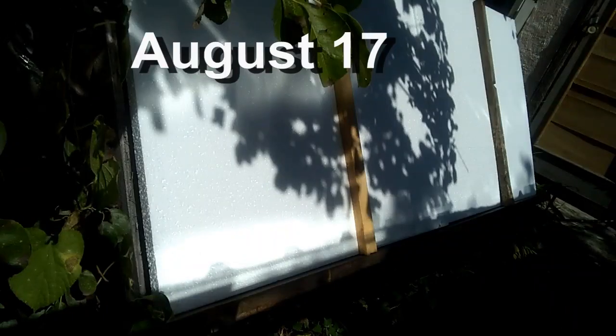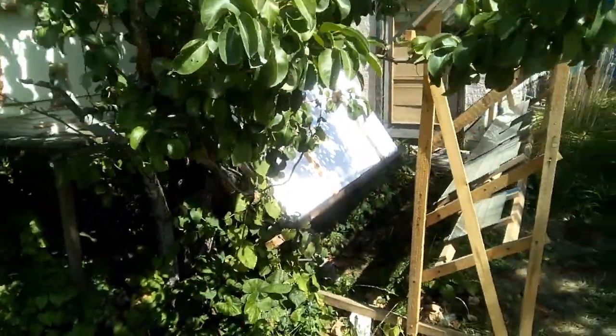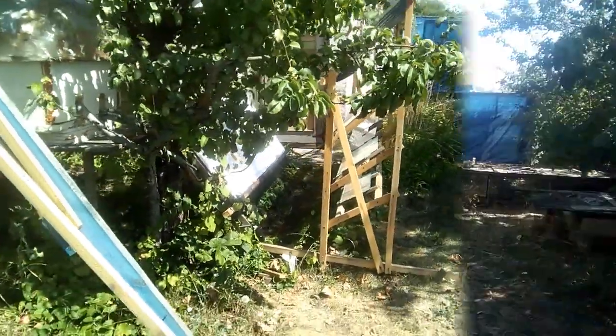This is the spot from my mirrors at noon on the 6th of July, but the spot shifted slightly down 10 days later. It is obvious that the spot will shift down day by day, because the height of the sun above the horizon decreases. However, the spot will shift upward until the summer solstice, when the spot position is the highest. We may think this problem will be solved if we shift our solar heater up or down once or twice a month.